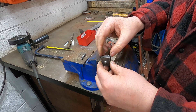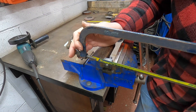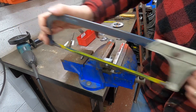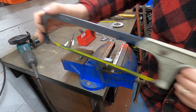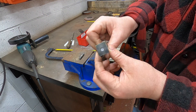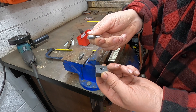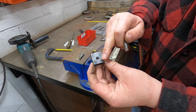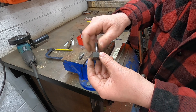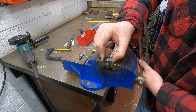Finger tight, just like that. And using a hacksaw, you can cut off the surplus — like so. And when you unscrew it, it knocks the burr back. And it doesn't make a mark because it's hardened — it doesn't wear, so you can keep cutting as many as you want. You can turn it around and cut the other side, and just keep cutting until you have as many as you need.